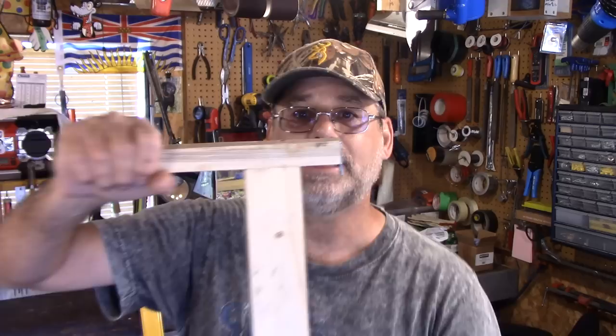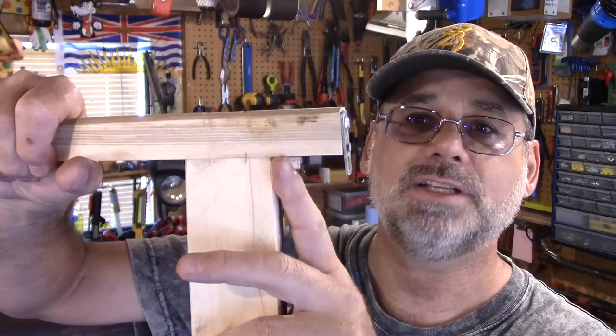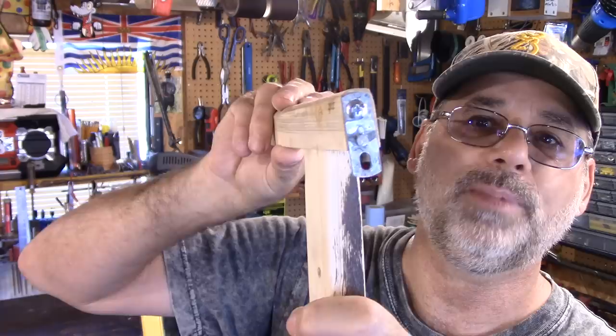I've had this for a long time — it's just a three-quarter inch spacer, because I like three-quarter inch spacing. If you take a look, the spacing is actually tighter now than last year when I built the first part of the fence, because the boards actually shrink. So all this is just a three-quarter piece of board with a little handle on it. It fits over top of a two-by-four and at the end it's just a clip that's been screwed and nailed — it just sits there so you can bring your board over and put your fasteners in.